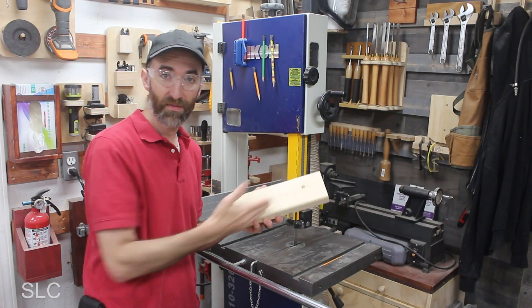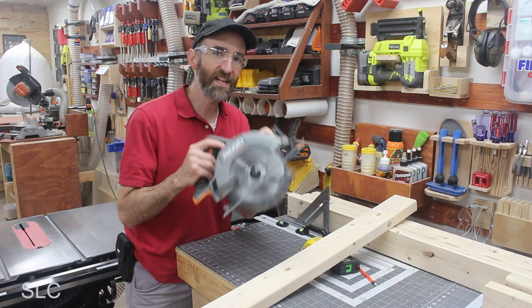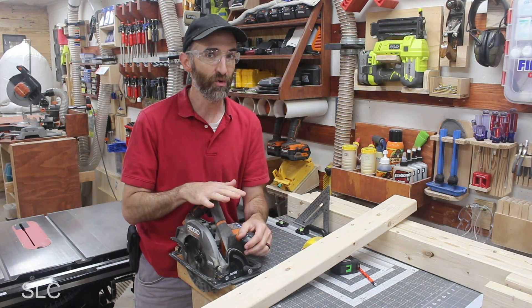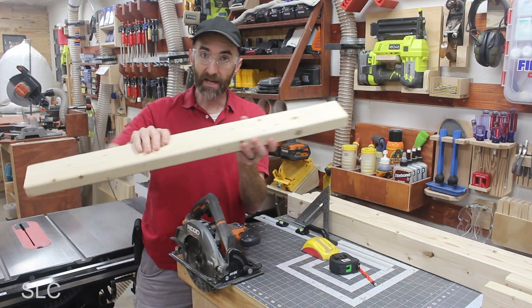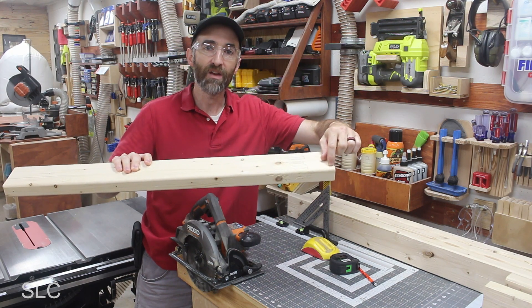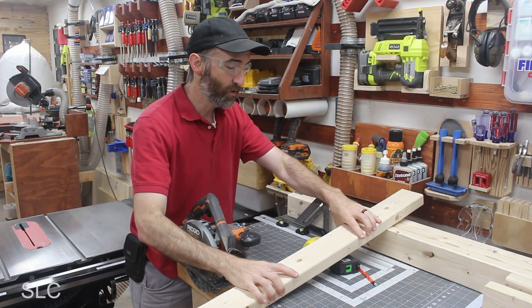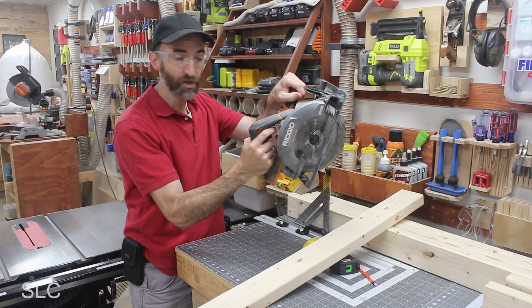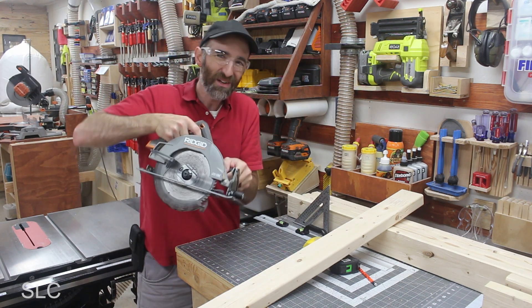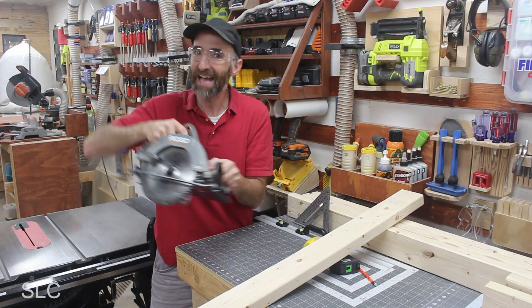I'm going to use a band saw to cut these angles out. But if you don't have a band saw, here's an alternate way: if all you have is a circular saw, you can make those angled cuts, though it is a little more dangerous so please be very careful. Before cutting those 11-inch sections off, first draw the diagonal lines across the board, then clamp it down to something solid so it doesn't move — that'll allow you to have both hands on your circular saw. Be careful, as there's a good chance the saw might try to lurch back on you, so make sure to stand to the side and not behind it.